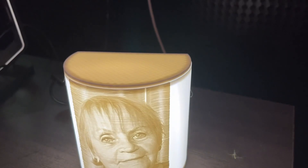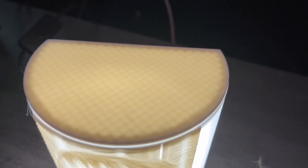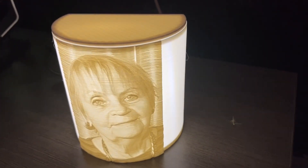As for the patterns, this is actually infill. The top and bottom layers still let some light through. However, the infill — because it is so thick height-wise — does not let light through. So you get a pattern like this. There are some patterns that can be chosen from, but this was just the basic pattern it printed with.